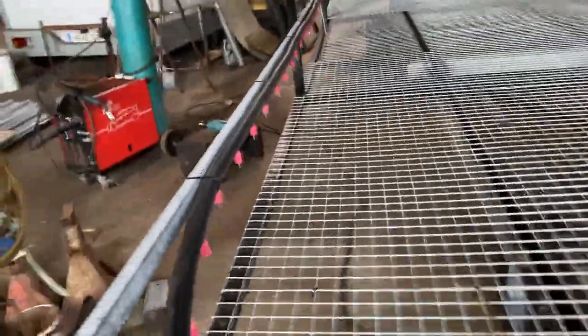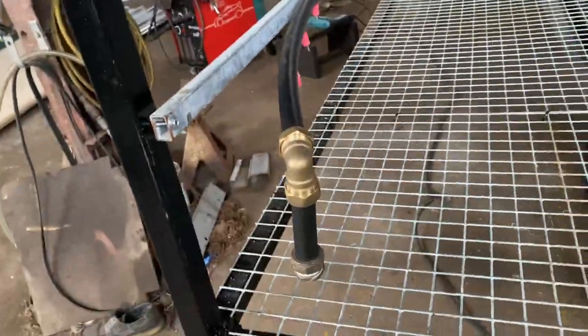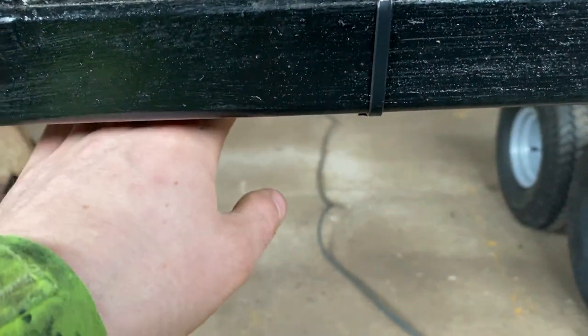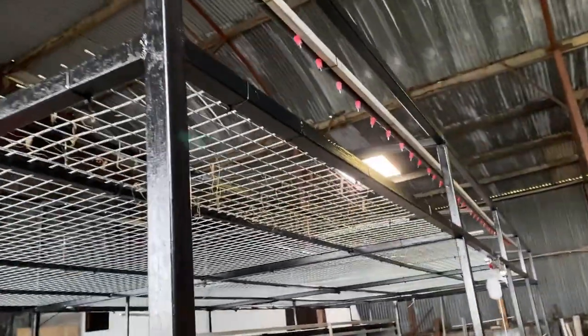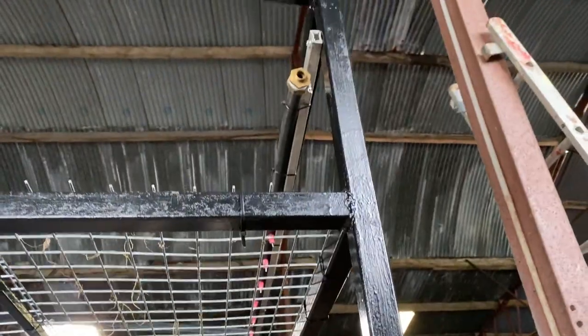There are 21 nipples on that shade cloth bar, and this is going to go down through the floor here. I've got to get some half-inch pipe coming down here. I'm going to put a pressure reducer valve just under here, maybe make a little box to protect it, and have a connection point where I can hook water straight onto it. There's also going to be pipe coming along the bottom here and up — I've got a whole bar with 30 nipples on the top deck, all ready to go. I'm waiting on some plumbing fittings, and I'll just tee into that, straight down then straight across, and have a connection point there for my water.